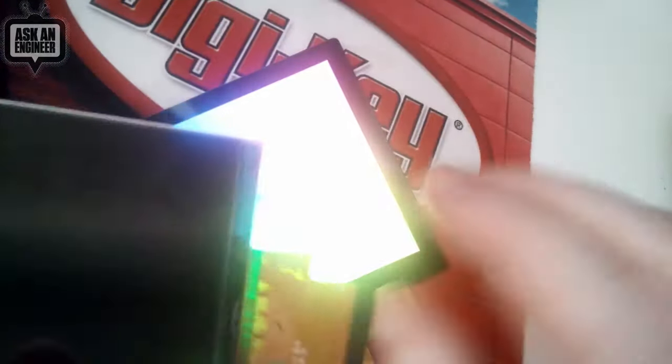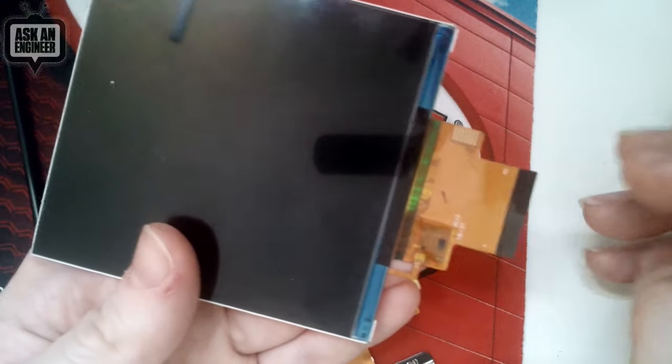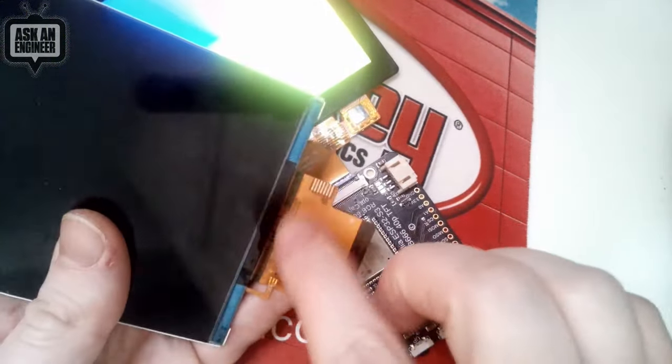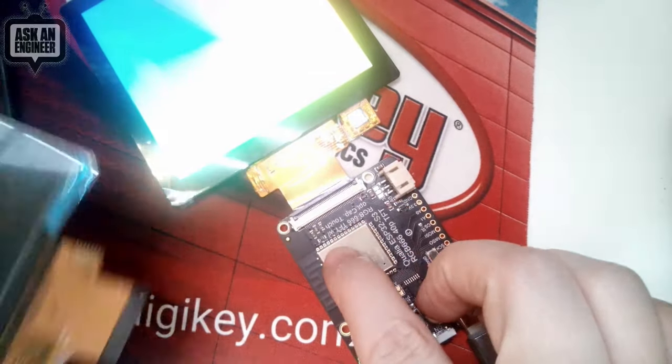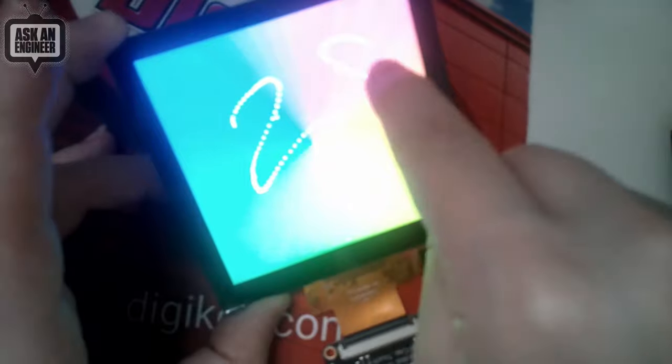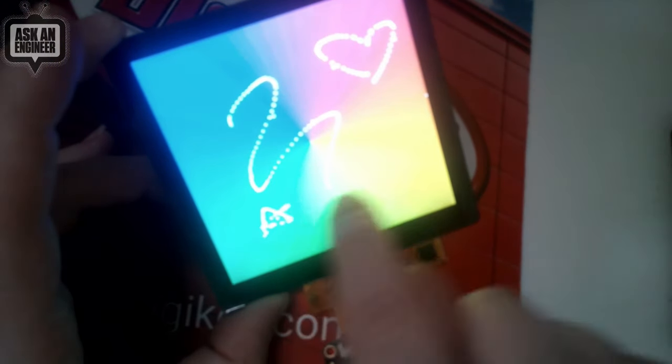Actually, this says 720 by 720, but it's not. It has the RGB TTL 40-pin connector, which works great with our Qualia board. Make sure that whatever you're using to drive these displays has that RGB 666 pinout. And then this is just a quick touch screen demo. So you've got the rainbow display, and then I can draw hearts and stars and moons